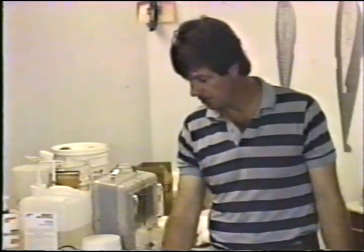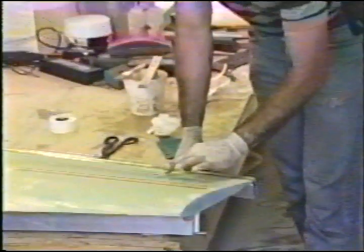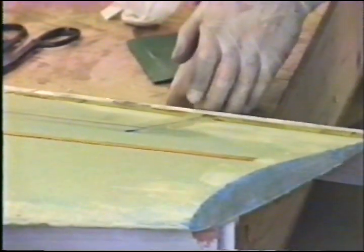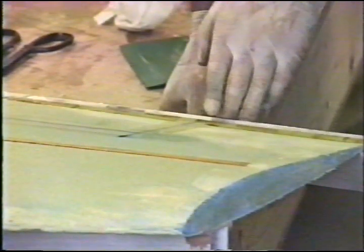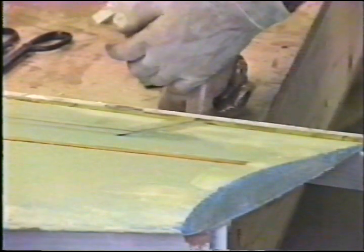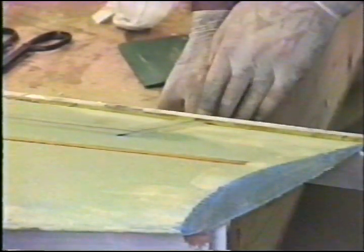Before I go with the laminated glass, now we've got the peel ply down, I realize that this gives you an opportunity to make a mistake. As I have seen in the past, the peel ply in this area must not lap the glass-to-glass trailing edge section. You'll never get the peel ply out of that area, and it would always remain a weak area prone to delamination. So do not allow your tape to lap onto the glass-to-glass area.